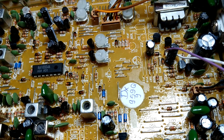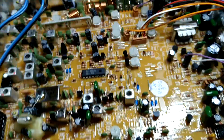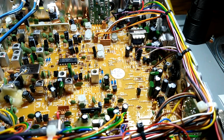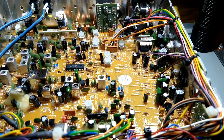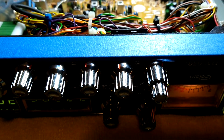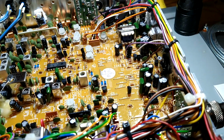Well, all that's doing is making this radio as if you turn that wide open, and now you have no more control on the front of the radio. Now you're wide open, probably 130, 140, 150% modulation all the time. And that would be fine if you had the control up here, but you no longer have it. It's just wide open. There's no adjustment. It's just maximum overdrive all the time. Don't do that. Just don't do it.